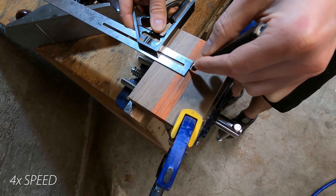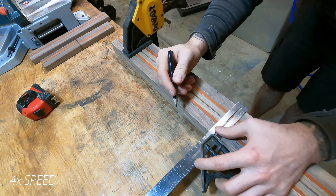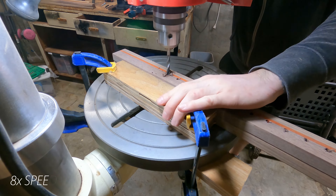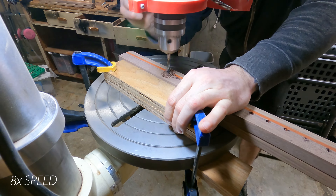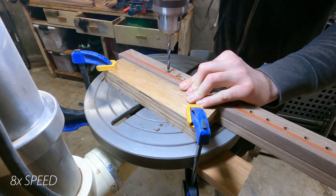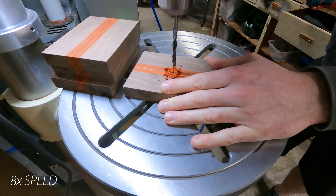Next it was time to mark out the centers on each board, draw out the 45-degree angles on each corner piece, and then mark out all the hole locations for the drill press. I stacked two pieces on top of each other to save time. I'm using a brad tip bit, which kept things cleaner. I set the stop on the drill press just before it punched through the back, so just the point came through — then made one more pass from the back to reduce blowout.